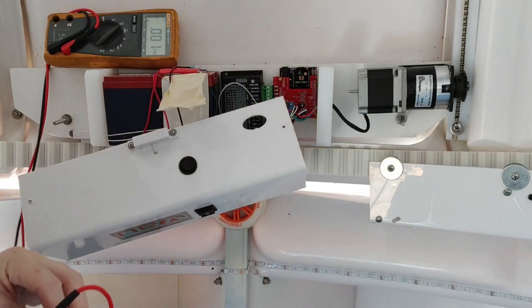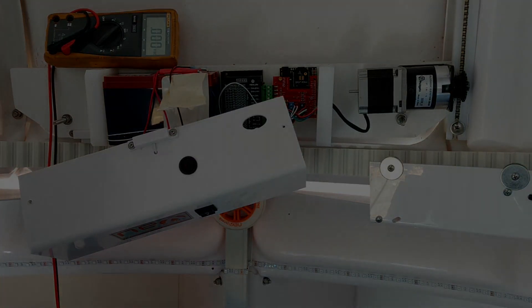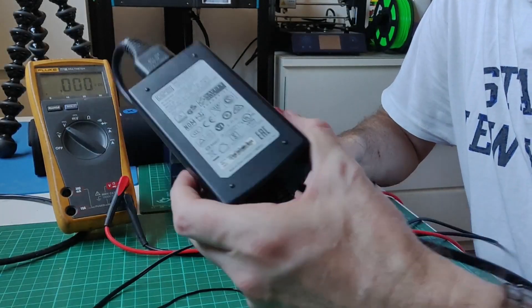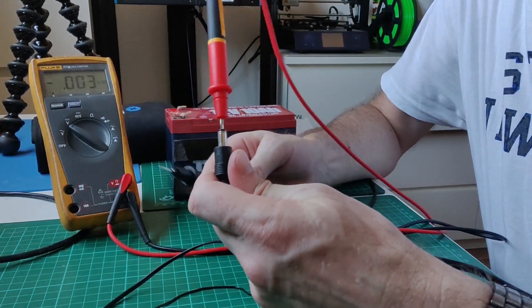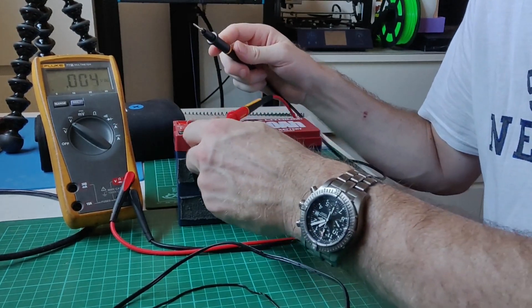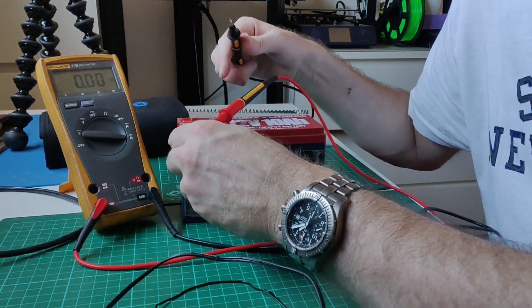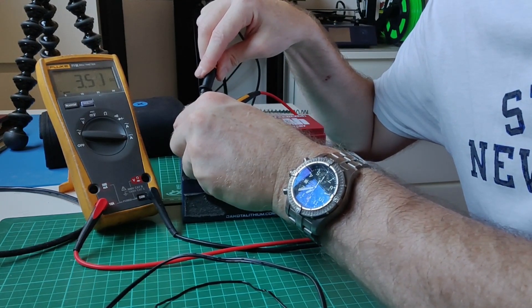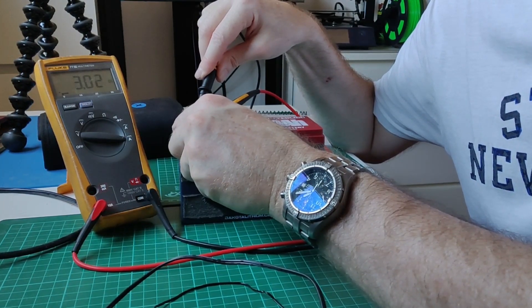What I'm going to do now is take the battery off, connect it up to another power source, and just give it a bit of power to kick-start the charging process. I've got a 12 volt 5 amp power brick from one of my other units — definitely 12 volts. I'll put the centre positive on the positive terminal and the shell on the negative, switch the meter to amps on the 10 amp range. There's 3 amps going into the battery, so I'll just keep it there for a bit.